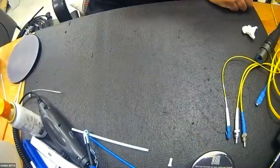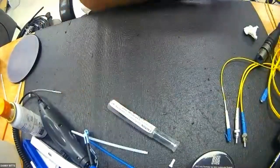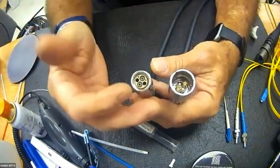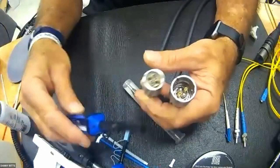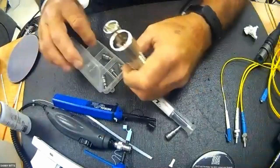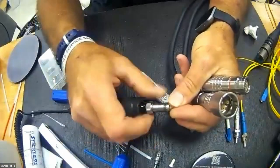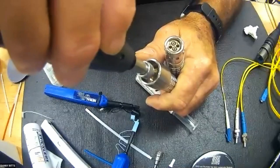Next, the LEMO. LEMO contacts are 2 millimeter, and in the case of a boy and a girl, the girls are exposed, they're two millimeter, and the boy connector, the 2 contacts are behind the sleeve. In either case, you can use a click cleaner that is specific to a 2 millimeter that would give you the ability to reach down over the contact, snap, to clean it, and also give you the ability to reach down inside, unlike any other way of doing this with a hand tool, but to actually put on the tip specific to 2.0 to visually inspect those 2 contacts down inside this connector.